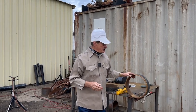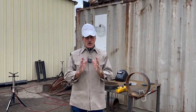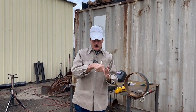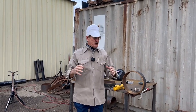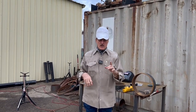The other thing you want to do when you cut them: if I was cutting these for a test, they would be six inches long so when I put them together I have 12 inches. Why do you need 12 inches? Because when you cut your straps — your pieces of metal that come across the weld to bend them into horseshoes — you need nine inches. And a lot of times you have a machine that sits on top of those two welded coupons, and you need 12 inches for that machine to sit up there right.